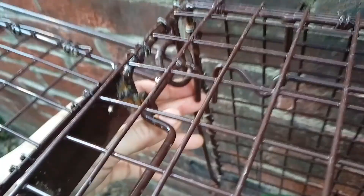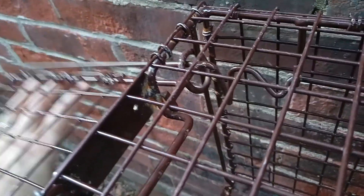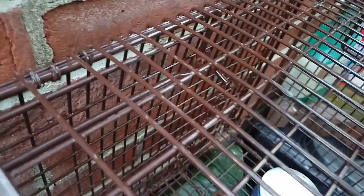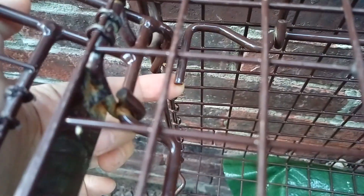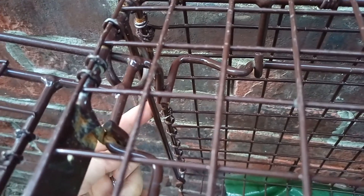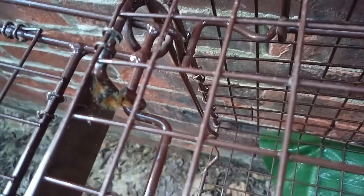So come and look inside. This is the side of the door, and you'll see where my hand is right now. This little bar is actually part of my free-falling door. To stop this door from falling, you'll see an opposite bar right here — it's a long bar that goes the entire length, and it's attached to the trigger plate. By turning the trigger plate bar to the horizontal position, the front door that goes down vertically can rest against it. They basically make a cross so that the door now remains open.